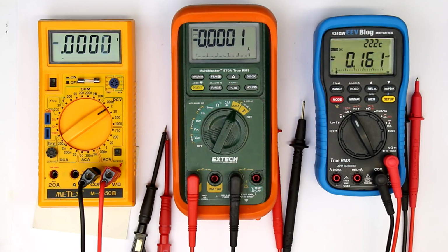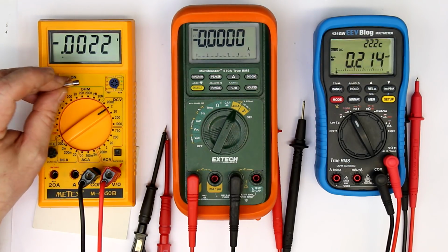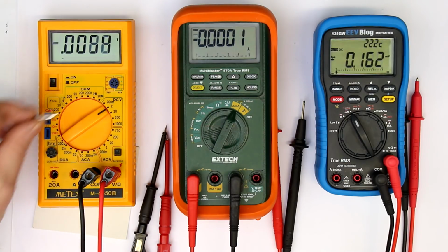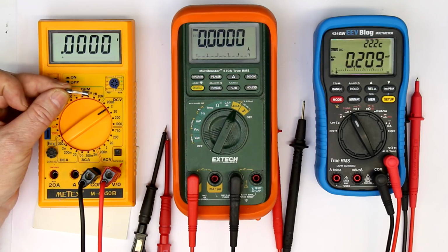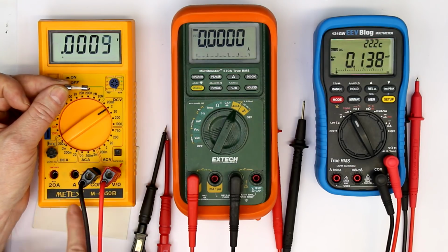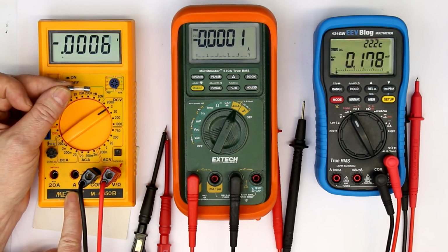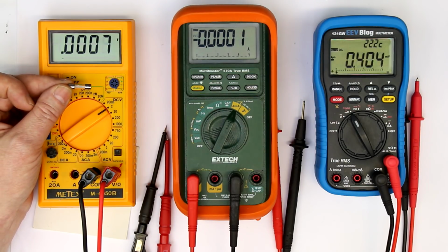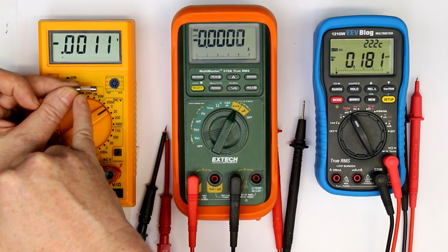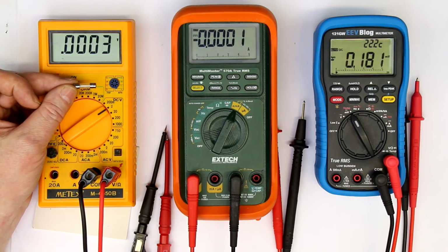So speaking of fuses and input protection, this multimeter here has a single fuse only in the normal amps range, going up to 2 amps. And it has a simple 5 by 20 millimeter glass fuse. And these glass fuses are no longer used in modern multimeters simply because they can explode. Just imagine that you accidentally probe the mains voltage, a mains outlet, in the amps range, and this poor little 2 amps fuse now gets a surge current of perhaps 100 amps, and then the little wire inside will evaporate, and the pressure of the evaporated gas will just make this little thing explode. And that is not a nice thing.